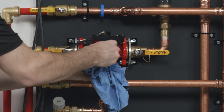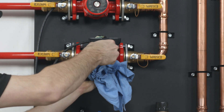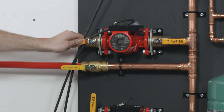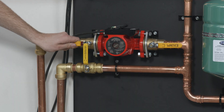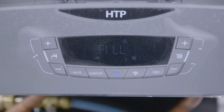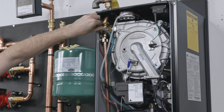When you get only fluid, you can close the screw and repeat this process as needed. The glycol feeder will resume pumping until the zone is full. Alternatively, the autofill will allow more water in. Repeat for all pumps or zones on your system. Plug in your boiler. Your boiler will turn on and begin the fill and purge cycle. Remove the lid of the boiler and open the air vent in the boiler until the liquid is free of air bubbles.